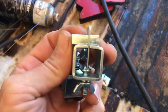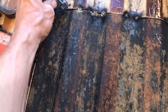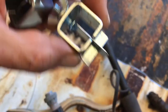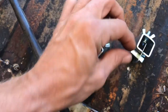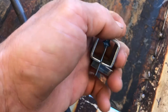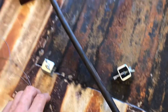They didn't have the tips I was wanting, but they had these little things for sheet metal. So if you're doing butt welds on sheet metal, you'll leave a gap. You put that down in there, the little slide bar goes across, and you'll have a piece of metal on this side and that side butted up, then you just tighten that little wing nut up and it'll draw those two pieces of metal together and line them up. This is a pack of eight for like six bucks — I should have bought about five packs of them.